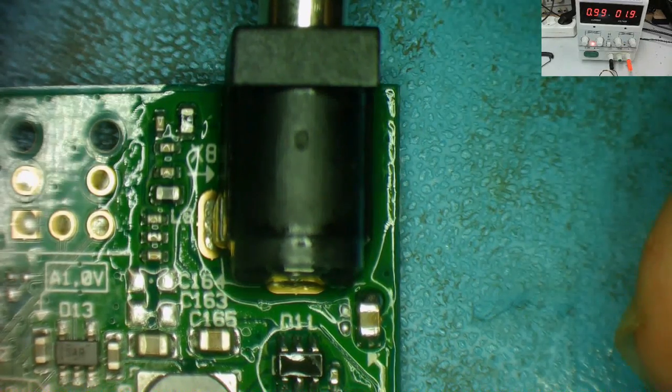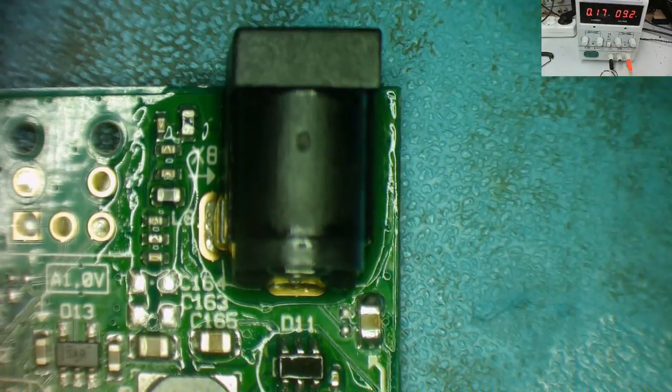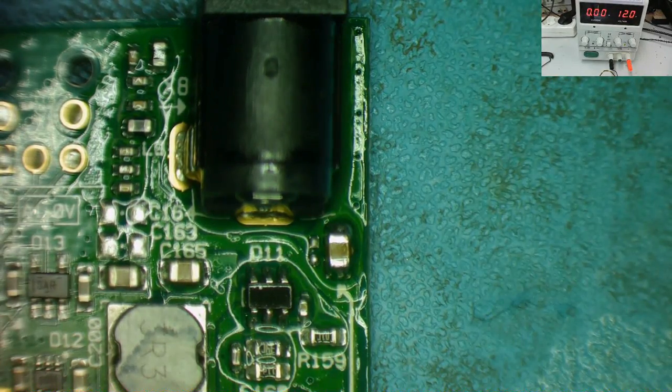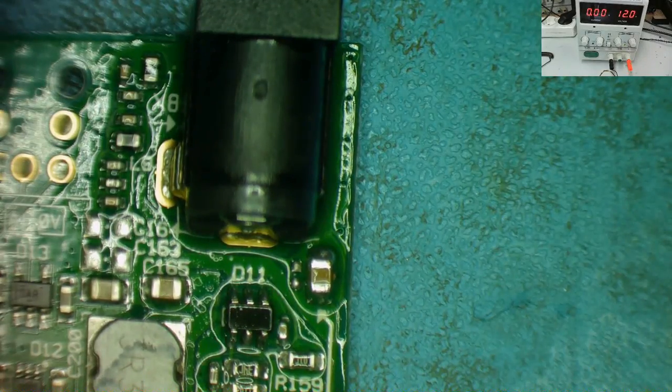You see it in this area, you see it smoking a little bit. Okay, so the problem here is the capacitor, and that's the one that I actually took off and put back on. Maybe one was short and the other one was already reading low. So yeah, okay, let's get that capacitor off the board and then let's see what this does.